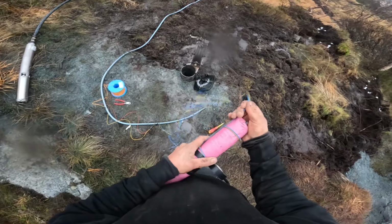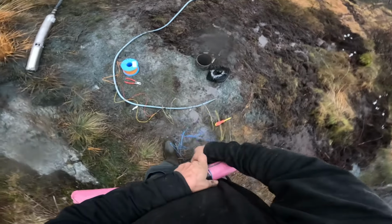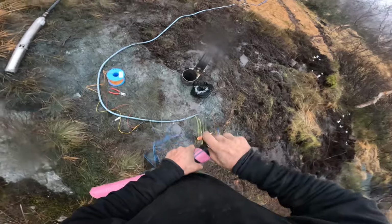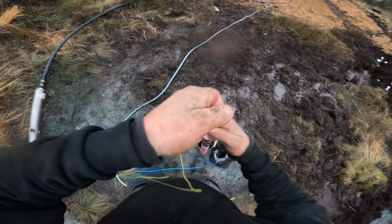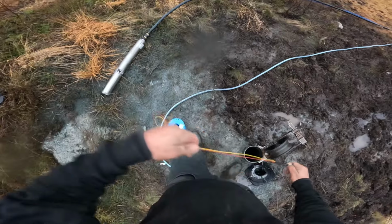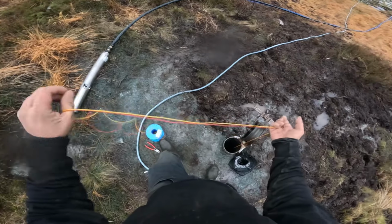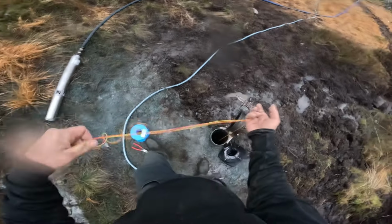Then I'm putting this upwards because the charge is here. I don't want to have this going first to beat in the bottom of the hole or into anything really. So that's why I'm putting the wire up again. And I like to put the charge in the first dynamite, because then you can make sure that it goes to the bottom of the hole. If you put the charge last, then maybe some dynamite will get stuck, and each dynamite is 2 kilos. And in this 90-meter hole I'm thinking to put 6 dynamites, so a total of 12 kilos.